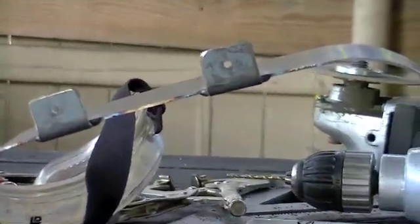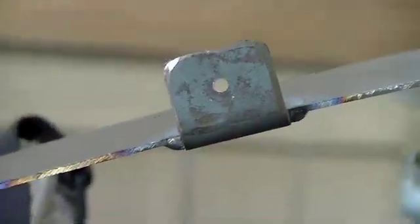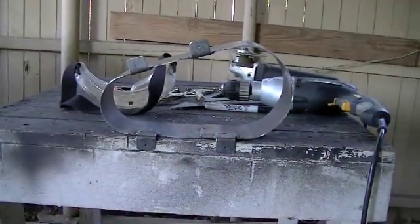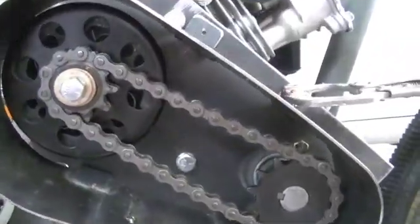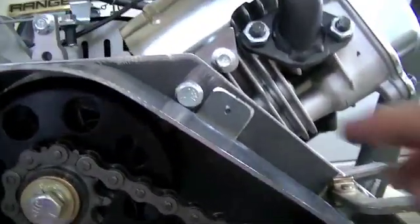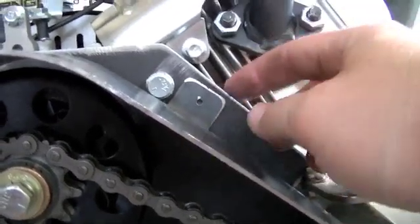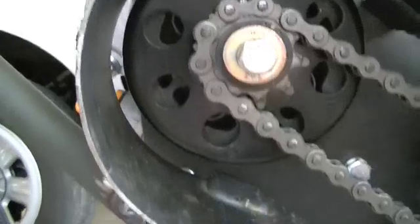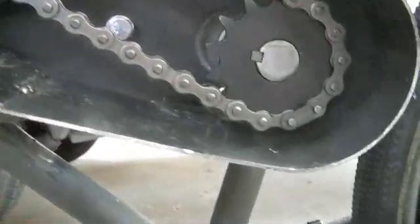As you can see, we got four small 1/8 inch holes drilled in all of our little mounting tabs. So now we just take the whole thing and clamp it up to the engine and get everything lined up. This is the part where you need to spend a lot of time before you clamp everything, because we're going to take the same 1/8 inch drill bit and drill holes into our engine bracket. You need to make sure that everything lines up and you've got plenty of clearance all around your components on the inside.